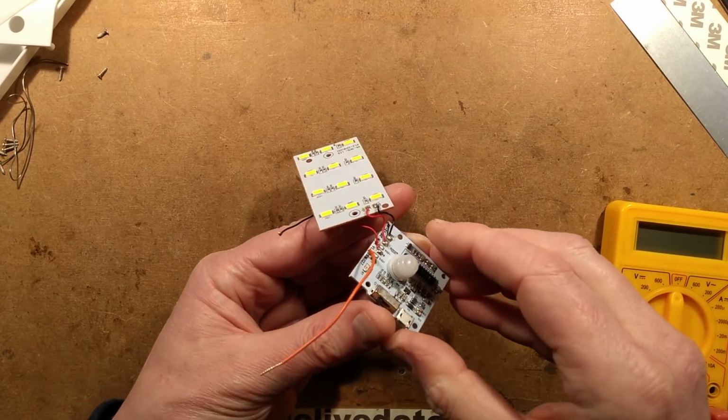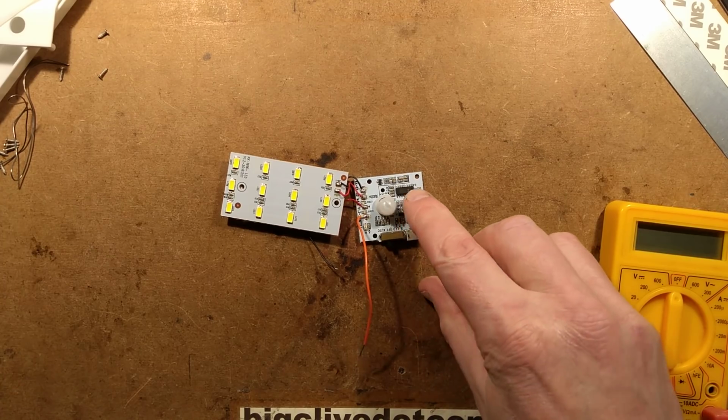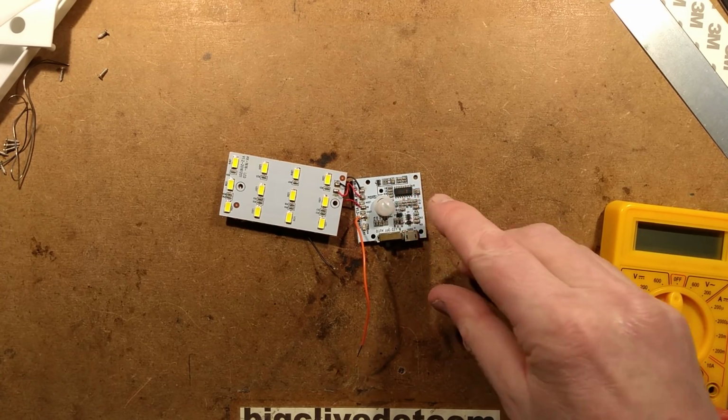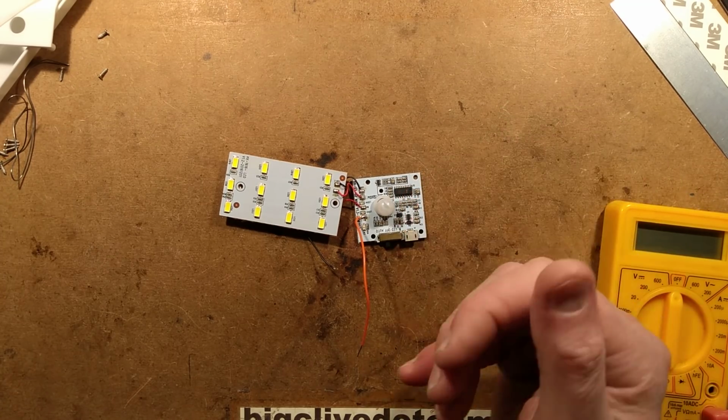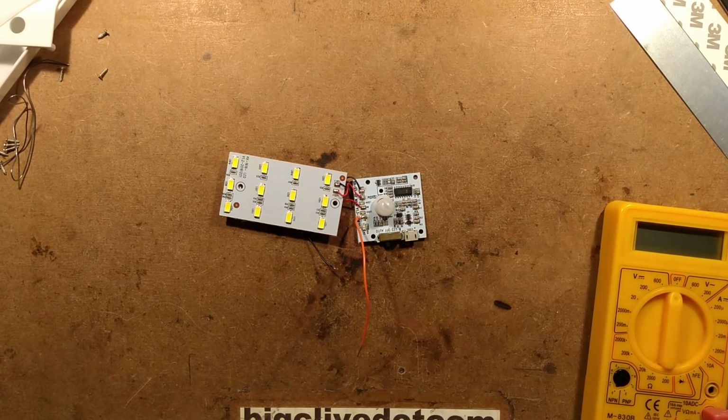The only slight niggle I can find with it is the use of the 3.3 volt regulator. I wonder if the BISS chip would have run down to 3 volts if they'd used a 3 volt regulator, and it would have just given that slightly wider margin at the bottom end of the battery range.